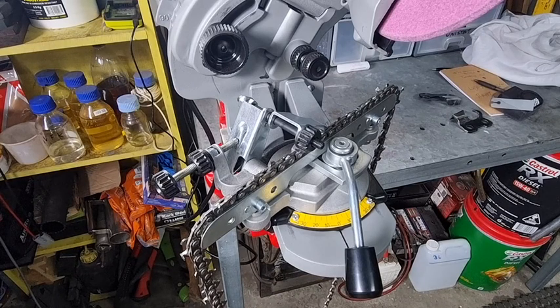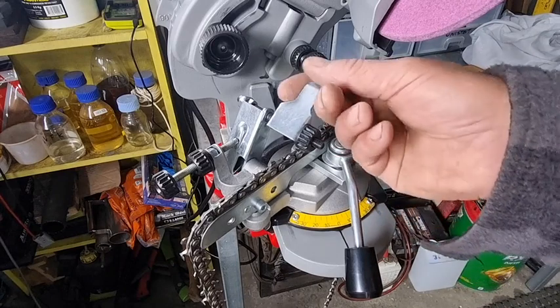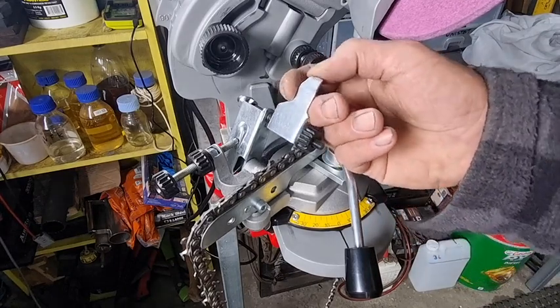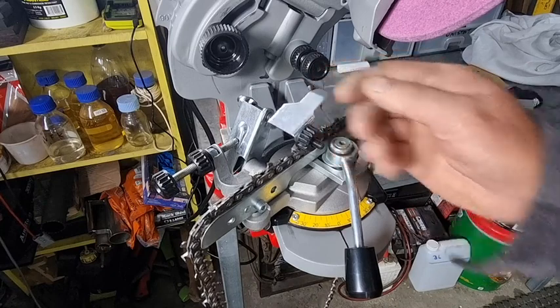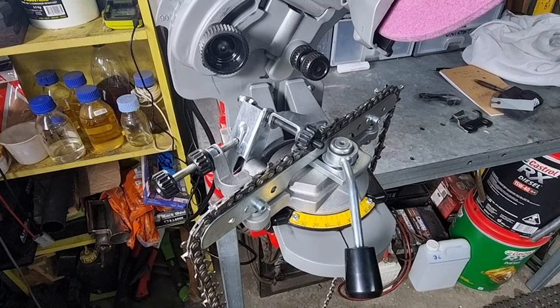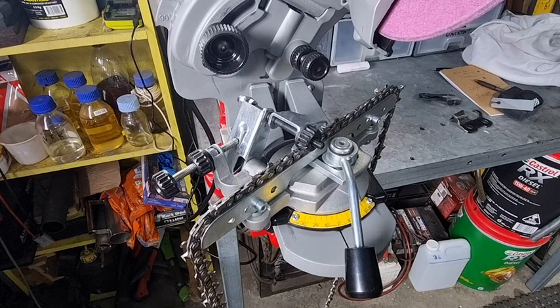It's okay to check like I just did, and everything was fine. Thanks for watching - there's not much else I can say about this unit. The only thing to be careful of is that when your tooth gets down close to the witness mark, the grinding wheel can come very close to this plate. I've already got a very slight grind mark on one side - you can damage these, but they're only about eight or ten dollars to replace. Anyway, thanks for watching. It's a thumbs up from me. Get yourself a good wheel - these pink ones are good enough for what I do, but if you're a professional I'd get a CBN wheel or a brown oxide wheel, which is even better.